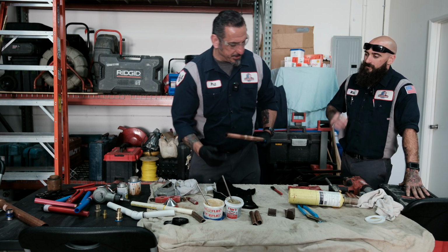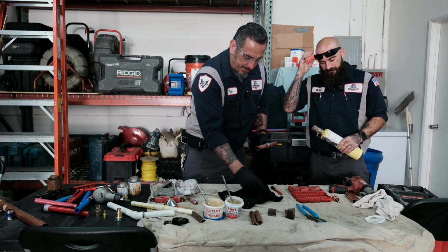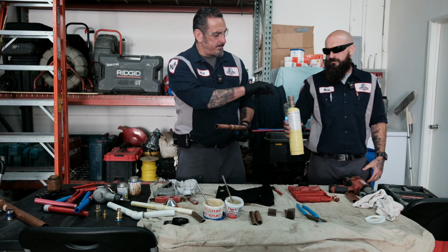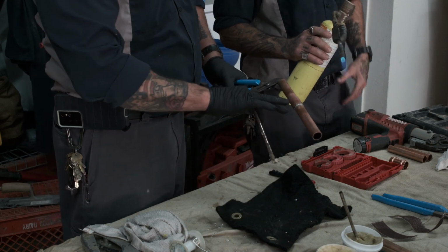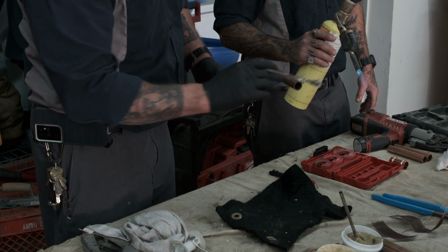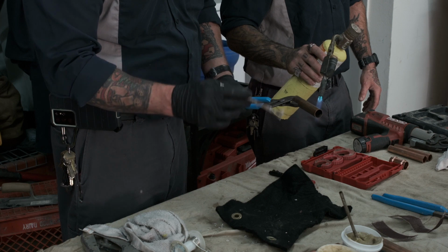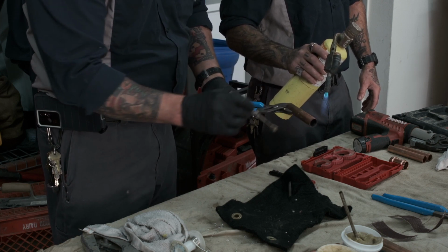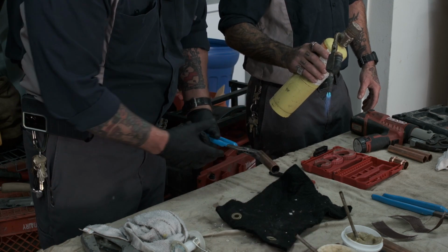Well, the other thing I do want to show you with this, Mike, can you heat the torch up? Flux cleans the pipe. So you see we had a pipe a little bit scuffed up. In fact, let me try this one. Mike, heat up the pipe. Flux also cleans your pipe. Very important to clean the pipe. But as you can see, how flux just really kind of cleans that.